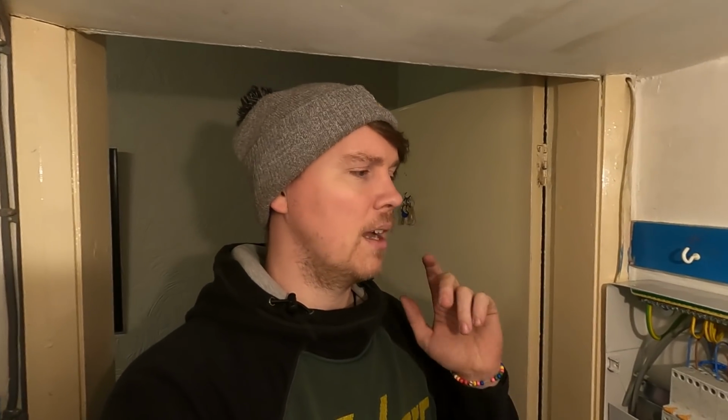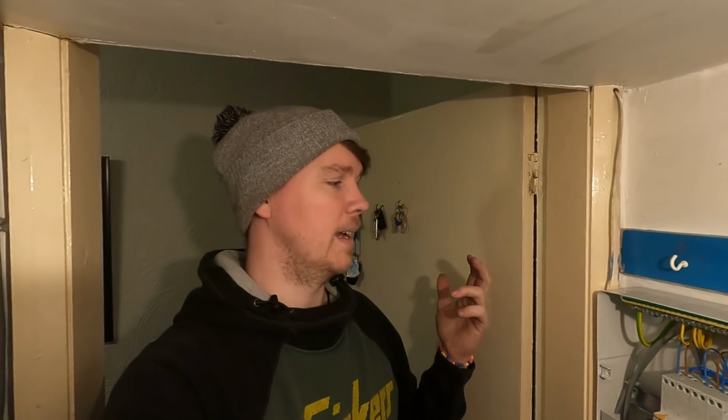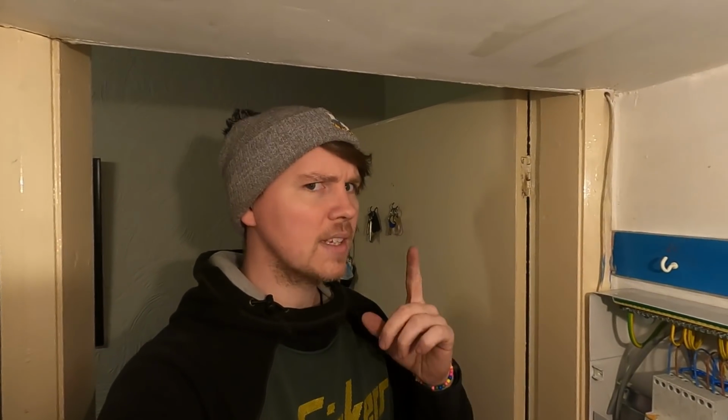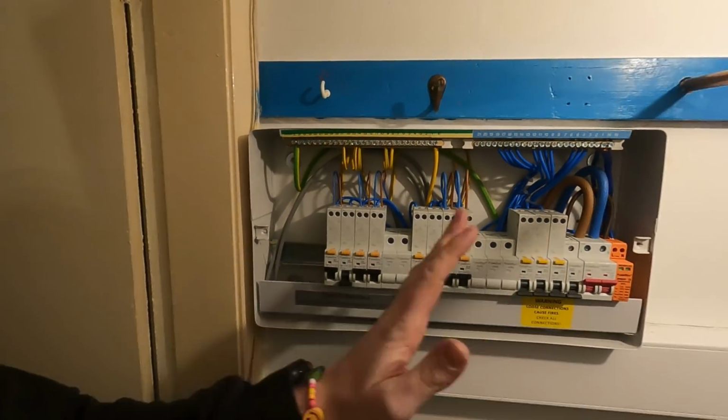We'll get our PFC, our ZEs, our R1, R2s. It's very simple. There's no rings. We'll get our ZSs afterwards, and RCD trip times for our RCBOs. Fuse box are roughly round the sort of 26.5 to 28.2 we found.